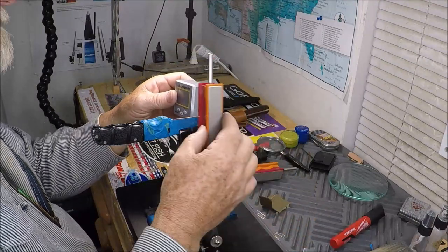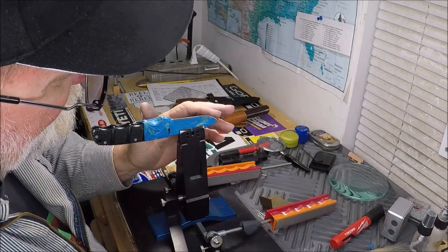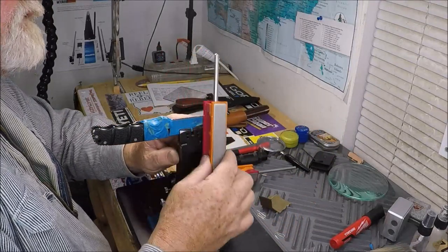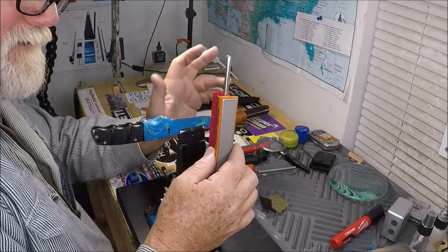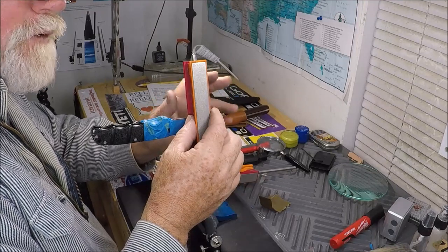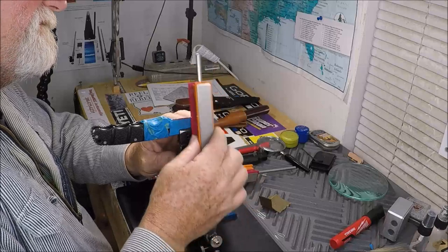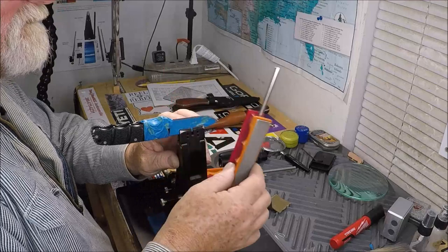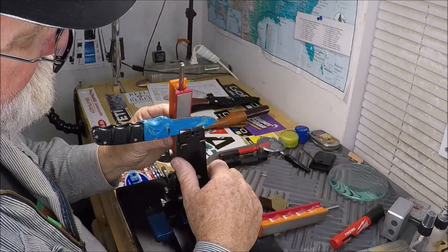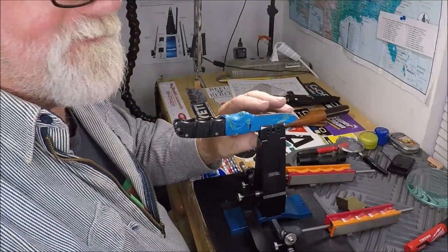Double check after running the 50 and 100. Now that we've got a burr and got the chip out, I'm going to run 100 grit. Then we're going to step through all the stones up to probably 800 or 1000, and then top it off with the fine and coarse ceramic. That makes a nice presentation — keeps it a toothy working edge. I just scrub up and down at first before we do any polishing. You can feel the burr getting smoother. I'm just up to 100 grit right now, and if I ran my finger across this, I'd slice my finger open.